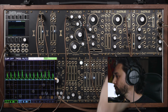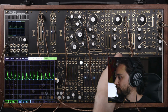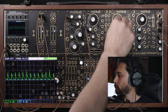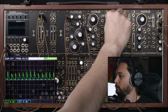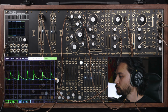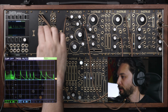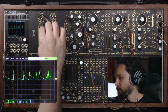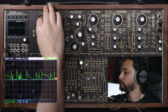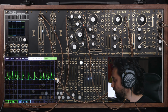I'll use the bipolar output and I'll use that to control my cutoff frequency because my primary cutoff control is essentially a bias starting point. Then I can use this envelope through the FM input. So this envelope is controlling both the VCA and low pass filter. We're very much in low pass gate type territory, and the exponential curve is very snappy, so it's quite reminiscent of a classic Vactrol low pass gate, but with a bit more control via CV in this instance.